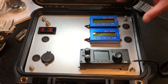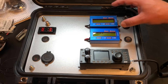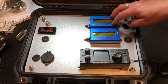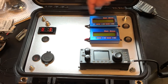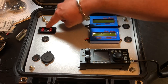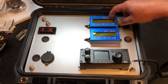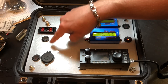I wanted to be able to monitor not only my station power, but also charging — whether from solar or from my home charger — so I had to wire this up carefully. I'll do a build video after this showing every single step. This top-left power pole is for solar in — it's connected to a charge controller and then goes into the watt meter. The top-right power pole is just for my home charger. Both go into the battery but are separate circuits. I had to put a switch on it because if I had this hardwired to the battery, the meter would always stay on. This main station power switch powers the two bottom power poles and the USB.